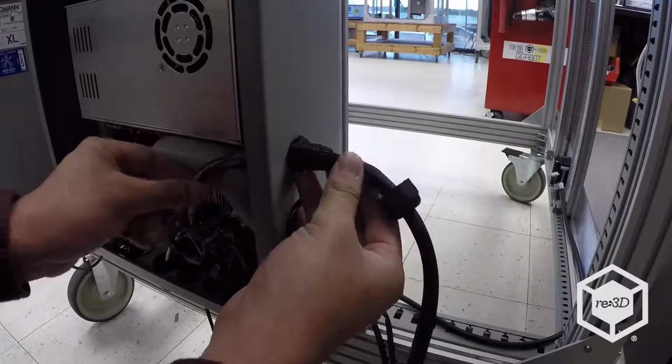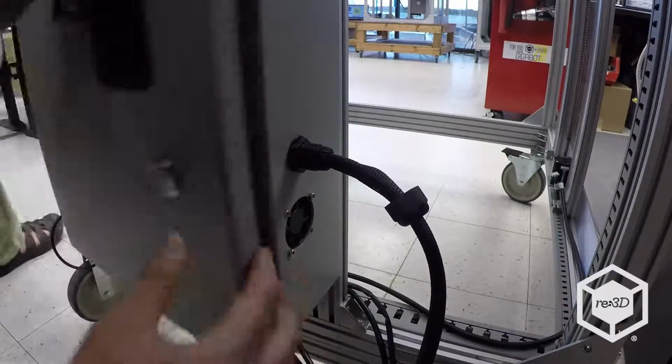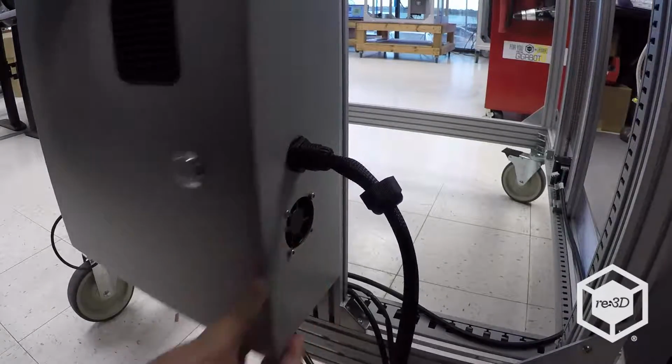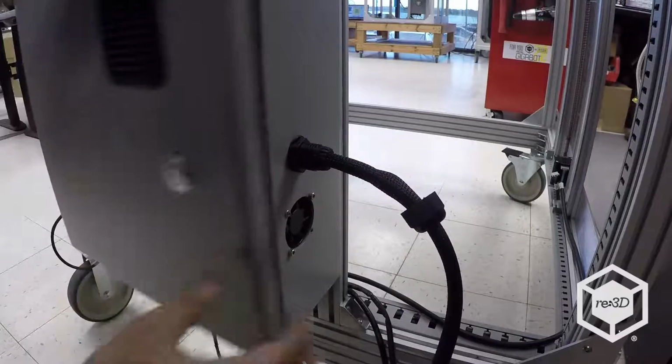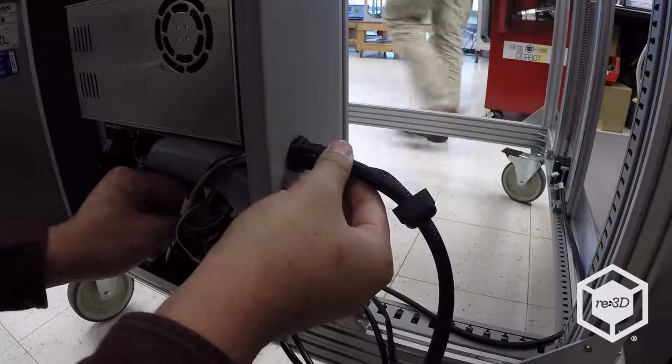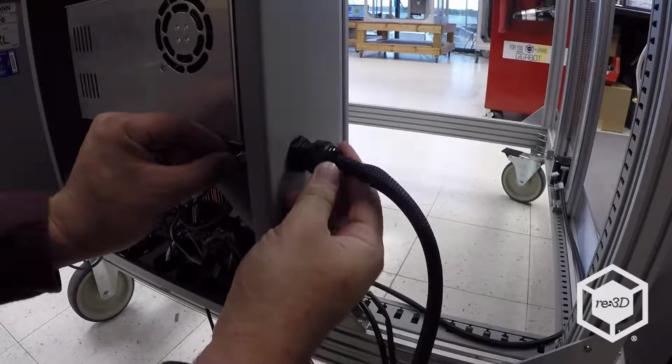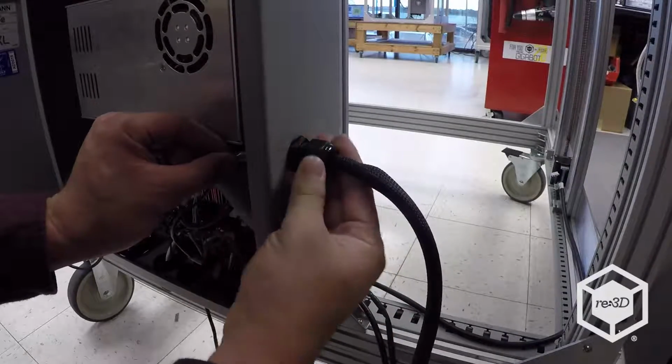Once the Viki is completely wired, tug on the wire bundle to remove the slack inside of the electrical box. Try to close the door to the electrical box and verify that the wires don't interfere with the door lock mechanism. Fully tighten the grommet cap to hold the Viki wire bundle in place, and then close the electrical box, locking it with a flathead screwdriver.